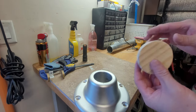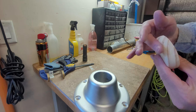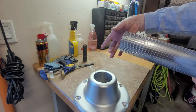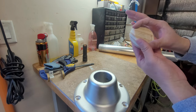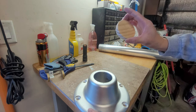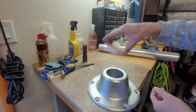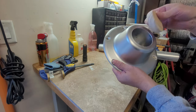Here's the finished piece. This took quite a while to make — over an hour. The inside piece has to be tapered to fit down to the bottom, because this leg is not straight all the way down; it actually tapers smaller at the very bottom. So you can't just cut a round piece of wood — it also has to taper smaller on the bottom side. This is probably not the most fun DIY project. If somebody has a 3D printer, you could probably make a piece that fits in here much more easily.